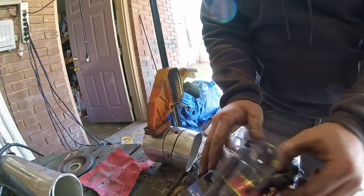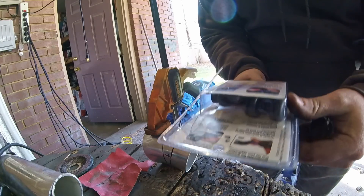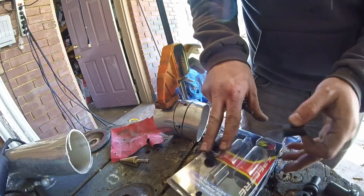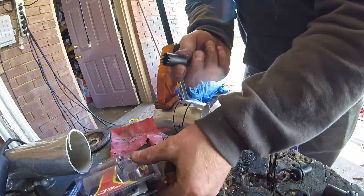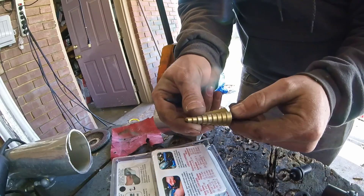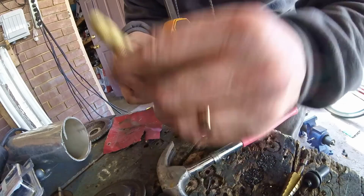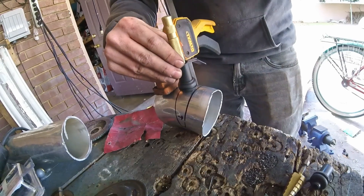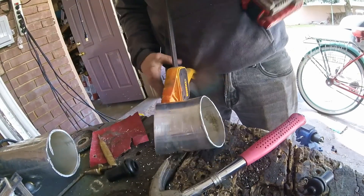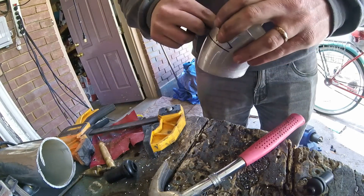That's gonna work great. This pack comes with a 7/8 hole saw, and there's another hole saw that's 5/8. I have this Christmas tree bit that goes up to 5/8, so I'm just gonna use that because I like it better and I'm pretty sure it'll work a little better than the hole saw. I center-punched that — it worked. That's a pretty crappy hole saw but it did the job.